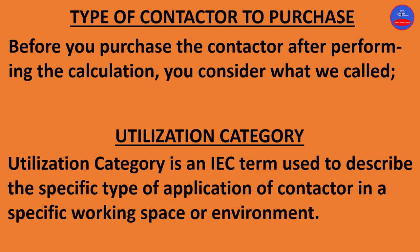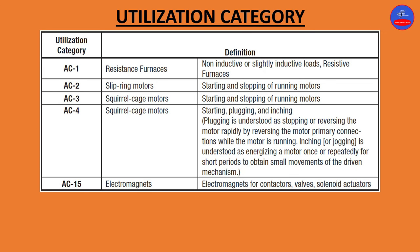After getting the size of the contactor — using the 1.5 margin we got 80 amps — we now know our contactor size is 80 amps. Now it is left for us to go and buy that particular contactor, and to know the particular type of contactor to buy, we use what is called utilization category. This chart shows the utilization category: it consists of AC1, AC2, AC3, AC4, and AC15.